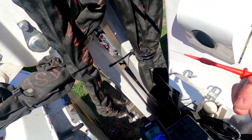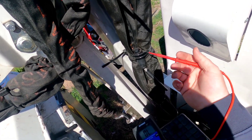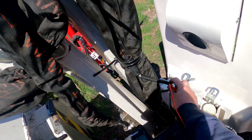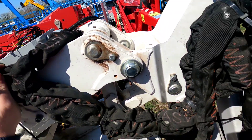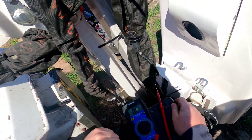Once we're done doing that and we confirm where every pin goes — that it has continuity through to its connections — that's going to tell us if there's a broken wire or not. If one of them doesn't pass continuity through to a connection up in the box, then that would mean we have an issue between where this connects and where it terminates up here on top of the jib. Thanks for stopping by and watching our video, and don't forget to comment down below.